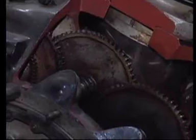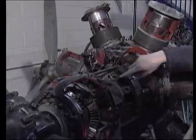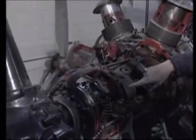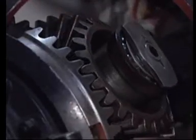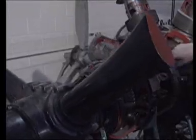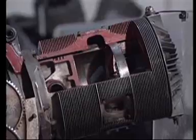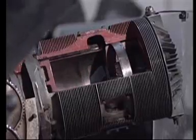The sleeves are driven by this train of gears at the front here, and then this big gearbox that you can see in front is the propeller reduction gearbox, driven by the engine, which is running at 2,800 RPM — much too fast for a big propeller. So this gearbox reduces the speed to 44% of that figure to drive the variable pitch prop and pull the aeroplane along.